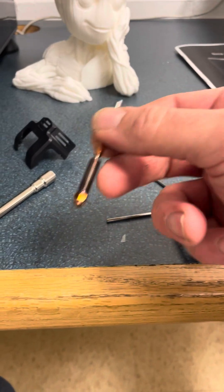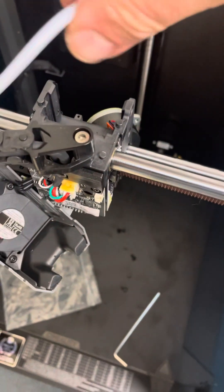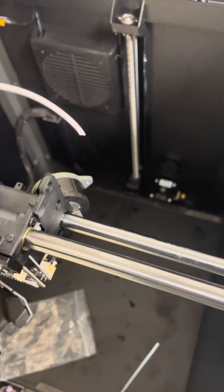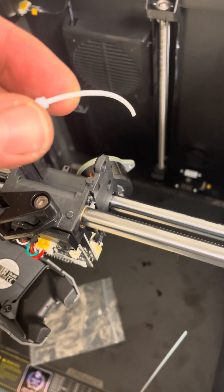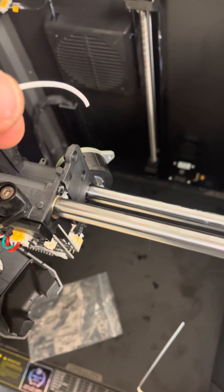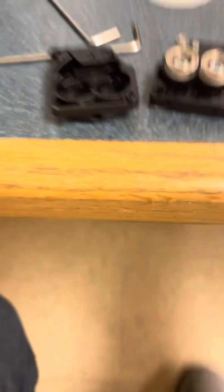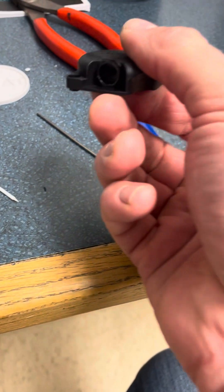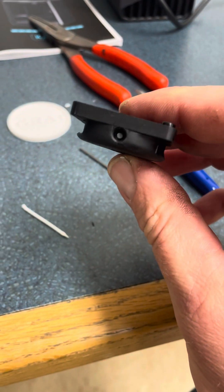I took this out and there was no filament in it. I wasn't able to pull the filament out of the extruder for some reason — it was stuck even with the unload button on. So what I did was I managed to get this pulled out of the extruder by being fairly rough with it. Then I cut the filament and I still had it stuck in the extruder gear. This is part of the filament that was stuck through the extruder — it goes through this side and out that side.